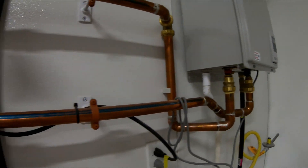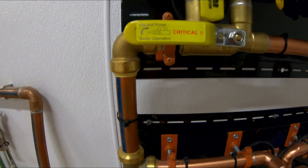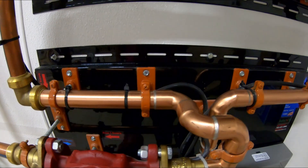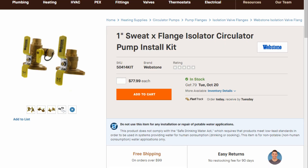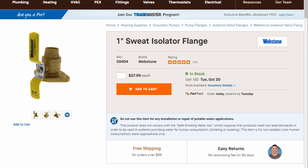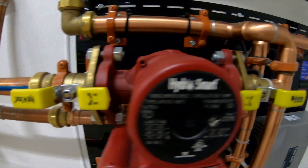And then it goes back to your boiler. Now that's your boiler panel. Now your zone panel is going to depend — all you need to do is add in more pumps. Now your isolation kit, you're going to use one of the flange ball valves. That's from your one kit that you bought. And then you've got your circulator pump.